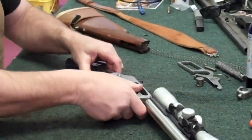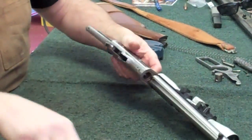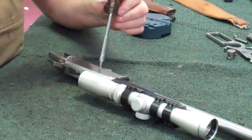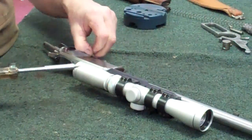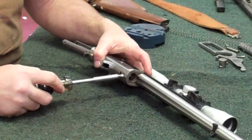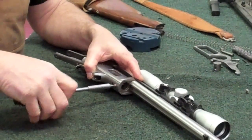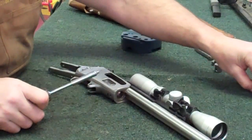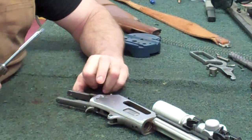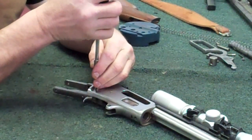The next thing we're going to do is remove a couple of screws — we're going to remove this one here, this one here, in that order. This is how you get your tang out the bottom. Now, these screws are going to be two different lengths, but they're threaded to the same thread pitch, and you've got to be careful not to put them in the wrong hole. That's why when I take them out, I set them off to the side to keep track of them. Remember, the long one goes in the front and the short one goes in the side. We've got one more screw right here which holds not only the back part of the tang but also the hammer in place — that's why I want to save it for last.